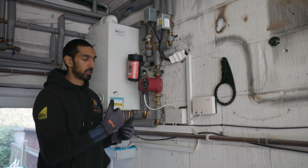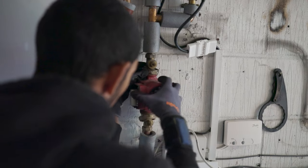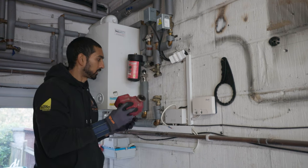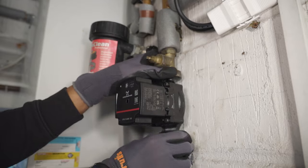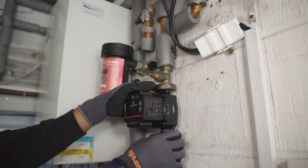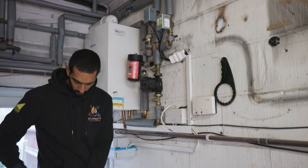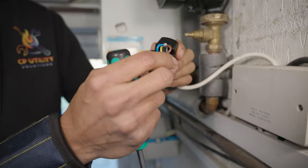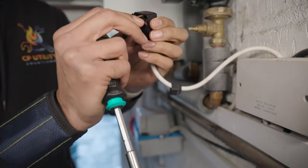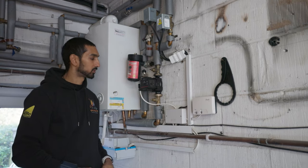Now all I've got to do is replace the pump. First things first, I've isolated the electrics and the heating system has been turned off. The new pump is now in position — I've got the top and bottom washers aligned, so I carefully do up the nuts making sure I'm not pinching the washers or cross-threading anything. Glands are all fully open, no issues with leaks. Wiring is very easy — it comes with a brand new connector plug, wire it in first and then plug it straight into the pump. Job done.